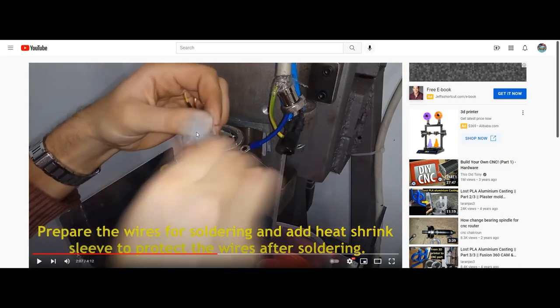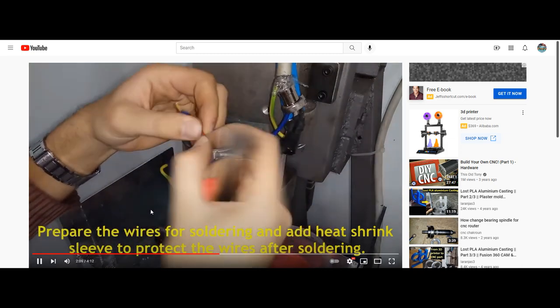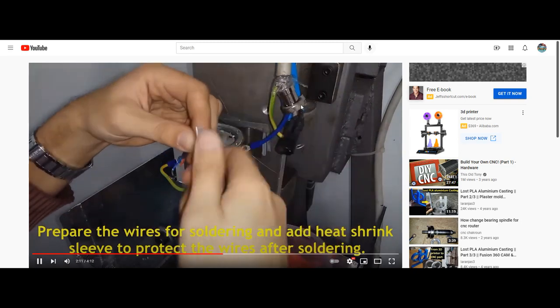Okay, this is something I have to discuss because I've had clients cut their fingers many times doing that. Never, ever, ever use a razor and slowly go around to trim the casing off. Use yourself a nice set of flush cutters, and just naturally rotate the flush cutters lightly around the casing, and it'll just pop off. If he slips with that, you can rest assured some way, somehow, you're getting a depth of cut in your finger, and hopefully not requiring stitches. I've seen it actually happen. You can see him doing it on every connector.